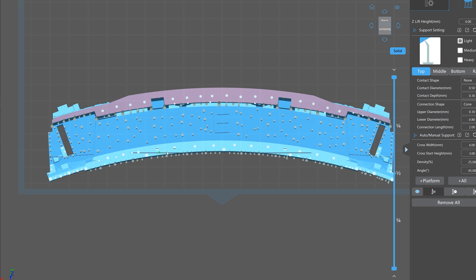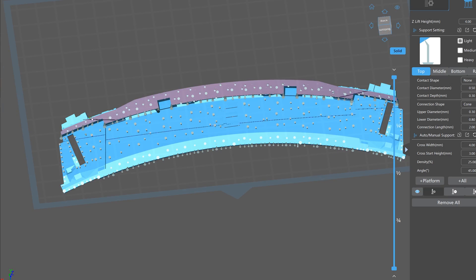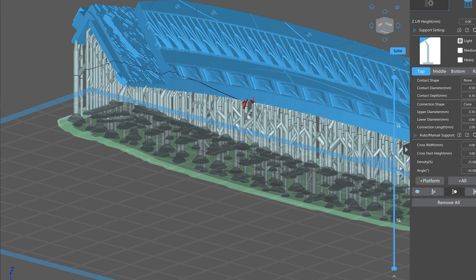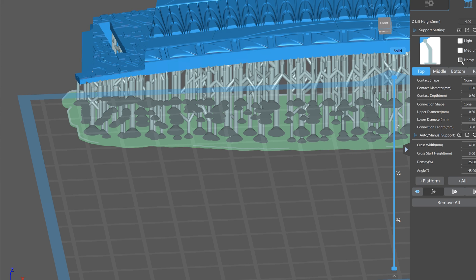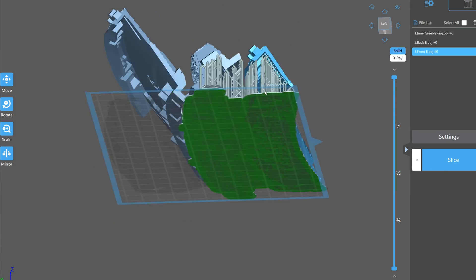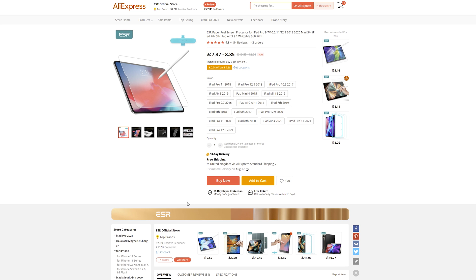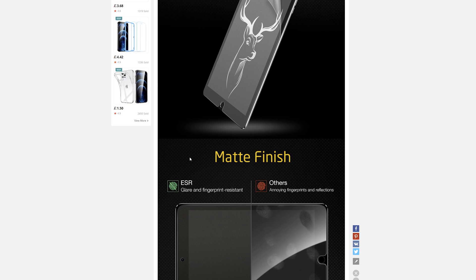This was the main thing I had to change — I had to figure out a way to get glass on the display. I had originally planned to have this done in January and a video uploaded, but as with all of my projects, there were unexpected delays. The first thing I had to do was figure out how to get screen protector glass that would fit the LCD panel. At this time, there were no off-the-shelf screen protectors for the size, at least none without notches or earphone holes already cut in. When looking around, it first appeared that it was possible to laser-cut tempered glass, at least according to some loosely suggested videos from China.